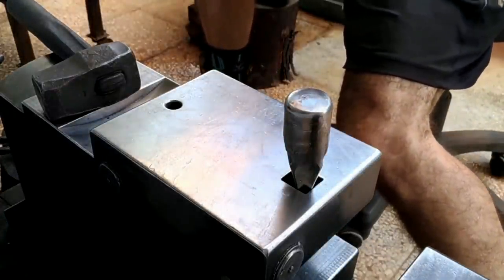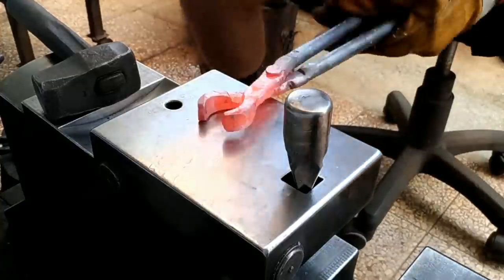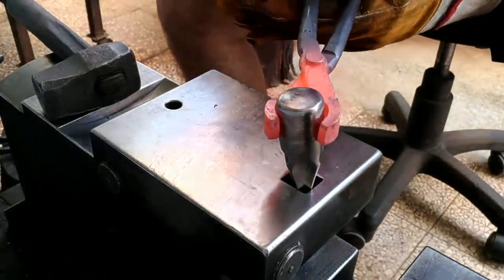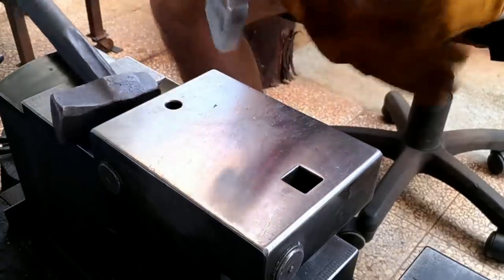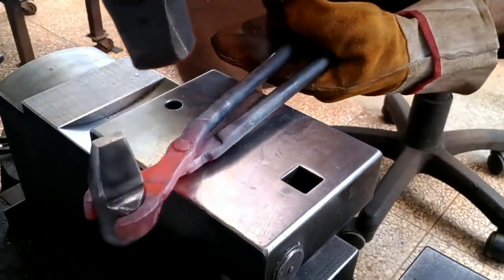I found this medium carbon steel to be very sufficient for punches, so long as the quench is done properly. And what medium carbon lacks in hardness, I think it makes up for with its extreme toughness.